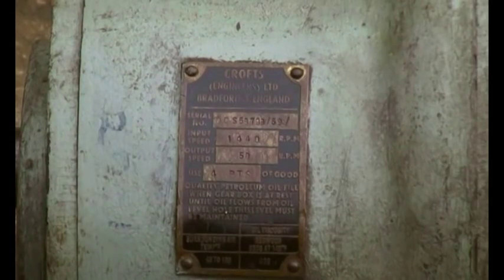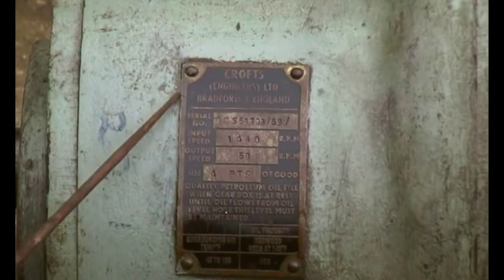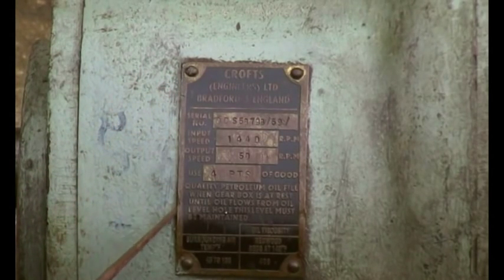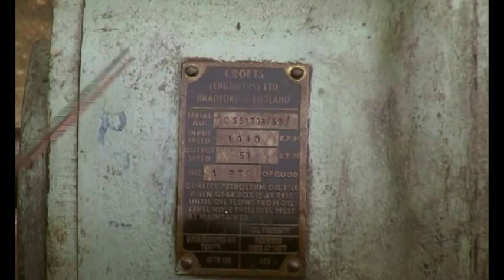Because we'll be running this fairly slow — we'll be putting something like 12 or maybe 14 revs into there — I think we'll just put a good quality engine oil in here. It doesn't want to be too thick and gloopy, it just wants to take the heat away and lubricate everything properly. Jim's going to come and pick this up in the next few days, he'll fit it, and then we're off for more experiments.